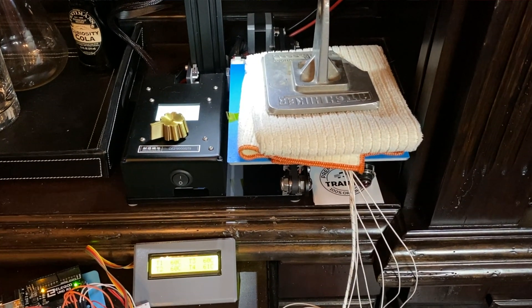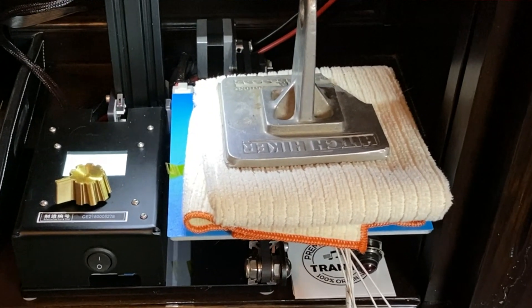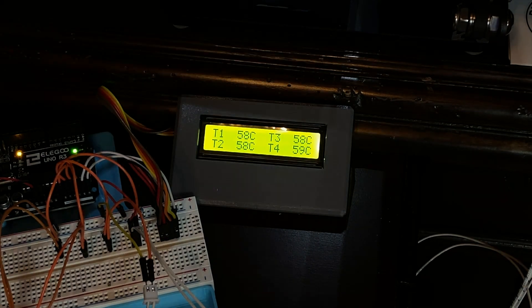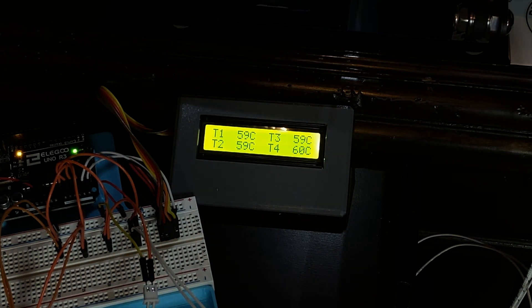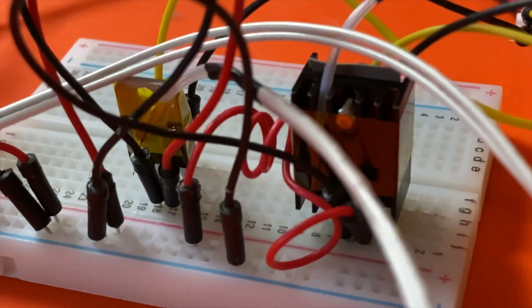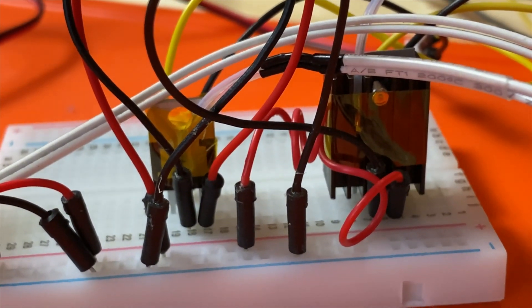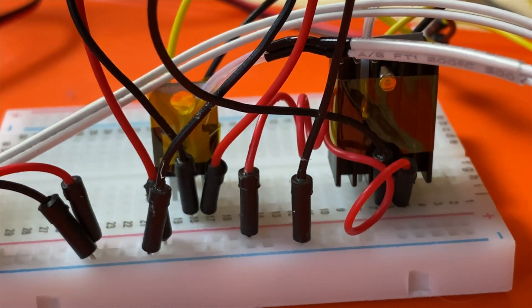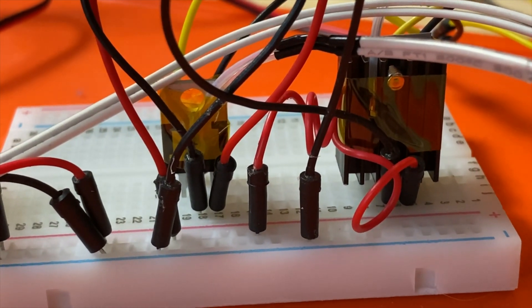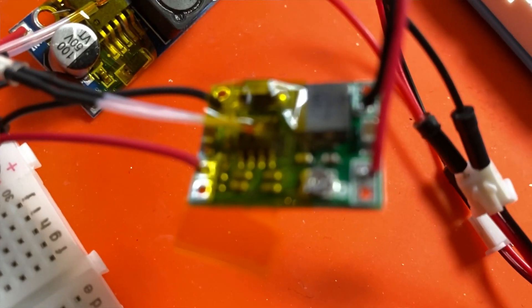I set the bed of one of my 3D printers to 60 degrees C, taped the thermistors to the bed, and put a towel over it with a little weight to keep the heat in — to verify they were reporting that temperature accurately. It measured 60 degrees C from all four thermistors once heated up, so I'm calling it good. On what may be the jankiest test rig ever, the thermistors are taped to the devices under test. The 7812 without the heatsink has the thermistor taped to the back of it; the 7812 with the heatsink has it taped to the heatsink itself. On the buck converters, I located the chip doing the work and taped the thermistors there.